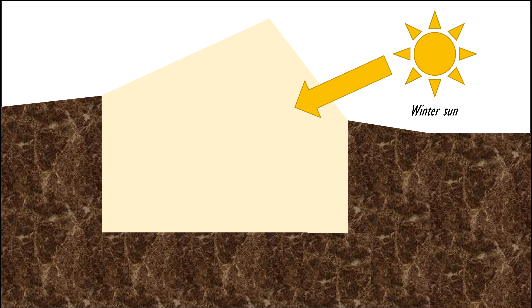Starting with the concept of the earth-sheltered greenhouse or wallapini, the basic idea is to use the stable temperature of the earth — dig down and recess the greenhouse into it to help buffer against cold in the winter or excessive heat in the summer. You just leave the top of it open to capture solar gain, slanting it more towards the south if you live in the northern hemisphere, to get as much solar gain as possible through the top of the greenhouse.